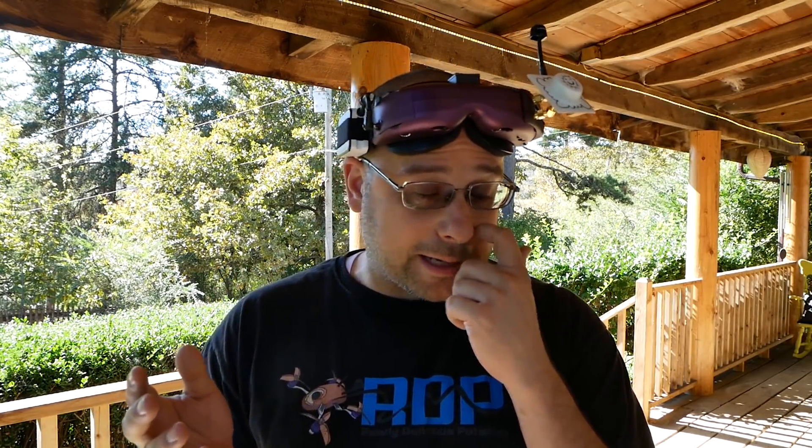The reason I've been avoiding RPM filtering is that this quadcopter has BLHeli S ESCs, and in order to get RPM filtering working on BLHeli S ESCs, you have to pay a couple bucks. The BLHeli devs just didn't add that functionality to BLHeli S — they were focused on BLHeli 32. So a guy named Joe Lucid did all the work to make BLHeli S capable of RPM filtering, and he released the code.